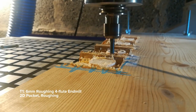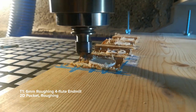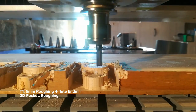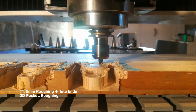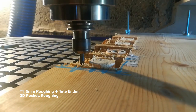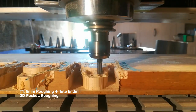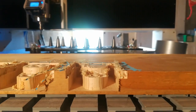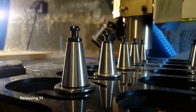In this case, it's using a spindle with a pneumatic tool clamp. I had lots of misadventures along the way. The first spindle wasn't properly grounded — a factory issue from the manufacturer — and caused breaker trips and shocks. I got lots of help from the community figuring that out. In the end, the manufacturer replaced the spindle.